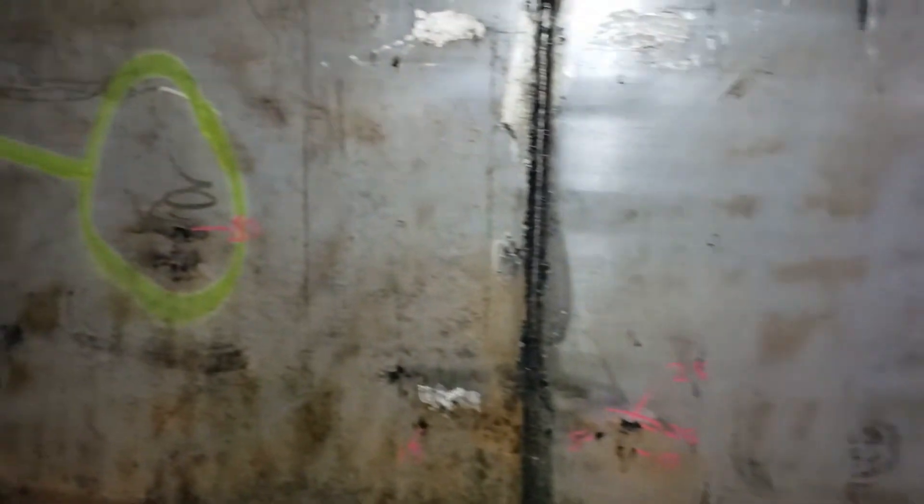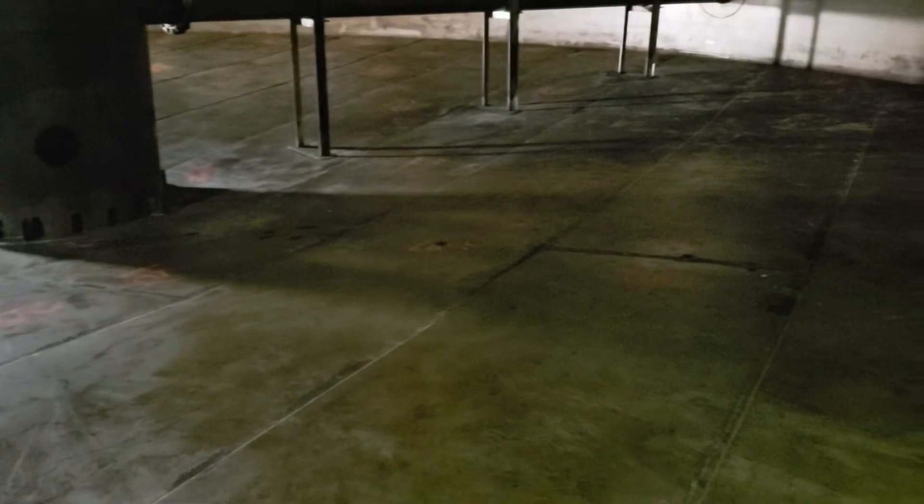The shell is showing a similar situation, but not near as deep. I think it's because, being the shell, the sludge isn't sitting on top of it collecting and corroding. Kind of an unusual tank — it's not every day you get to see a stainless steel tank this size. It's 60 feet diameter, nominal, and 32 feet tall, 7 courses — a series of 4 and 5 foot tall courses.